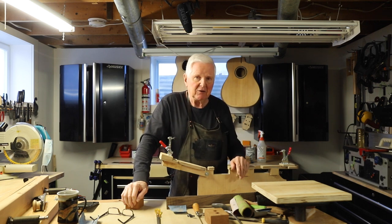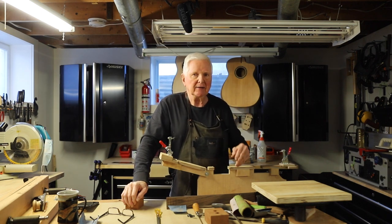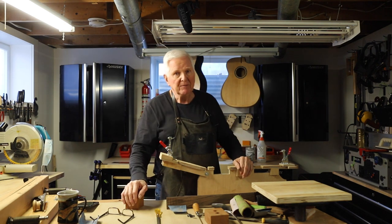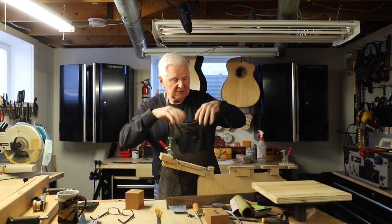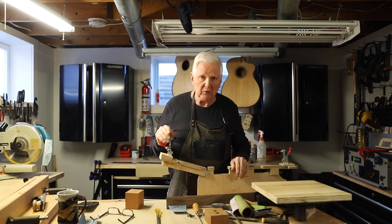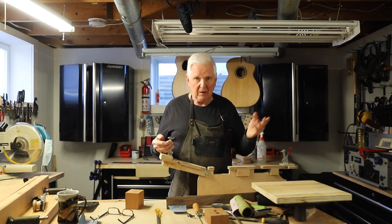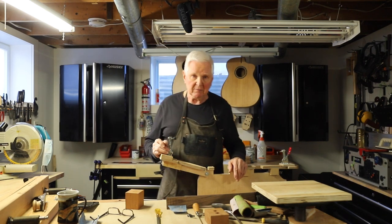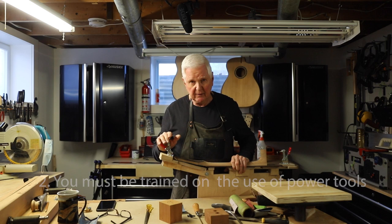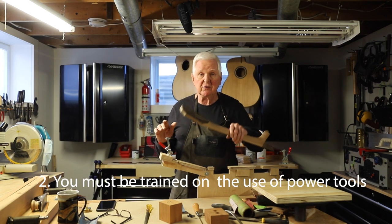But that's the kind of mistake you make when you're tired, and you could just as easily damage your hand or cut off your fingers on the table saw. If I wasn't paying attention and that saw blade — it's not up that high because it's just cutting the slots — but it's so easy to have an accident. I know a number of people that have actually damaged their hands on table saws and on band saws. Now that brings us to point number two: never use a tool in your shop on which you've not been trained. You must know how to use your power tools, even your hand tools, because you can get yourself into a lot of trouble.